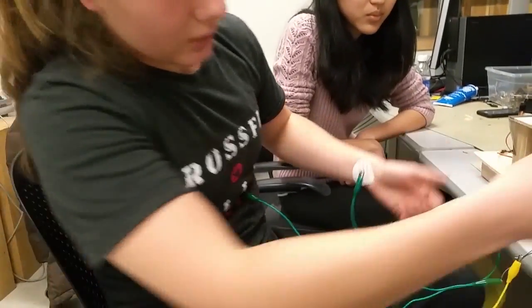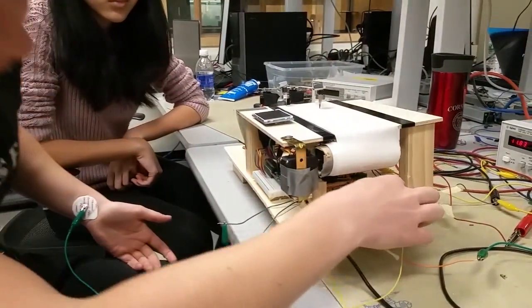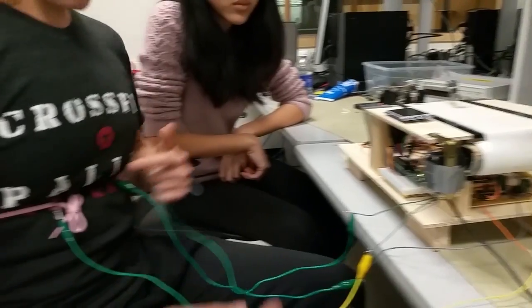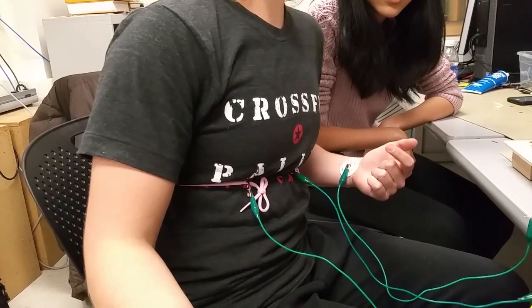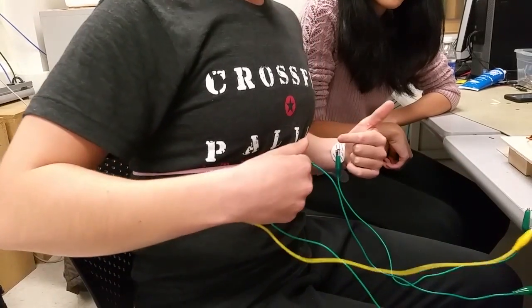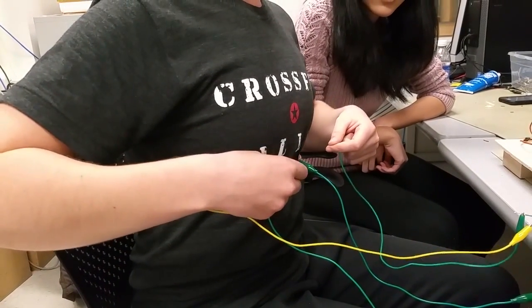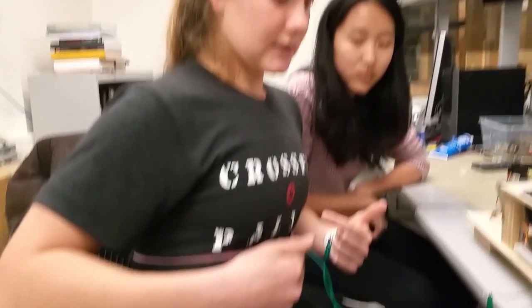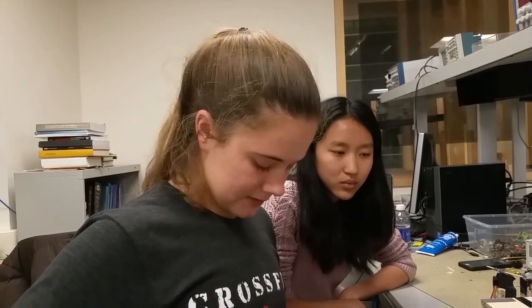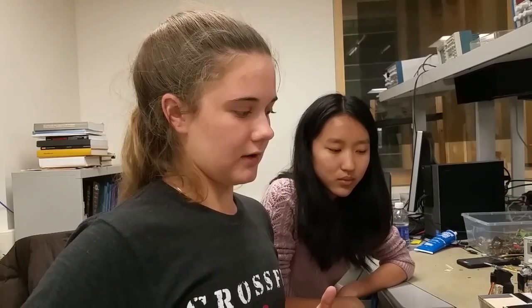The other circuit is also on here at the very end — it's for our stretch sensor, which is connected right here, and that's for respiration. As I breathe, it stretches and then compresses, and as it does that, it changes the resistance. So we measured the voltage across it. As I'm breathing, I can measure the voltage and it will change based on how fast I'm breathing.